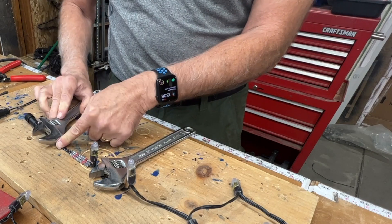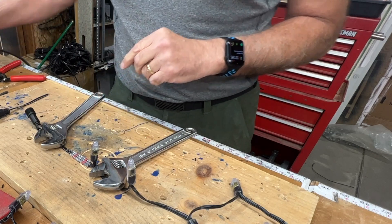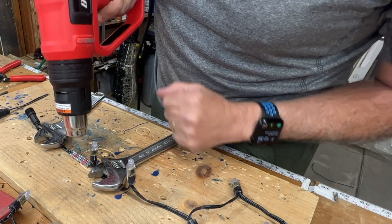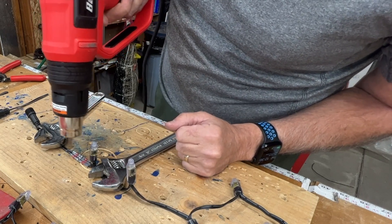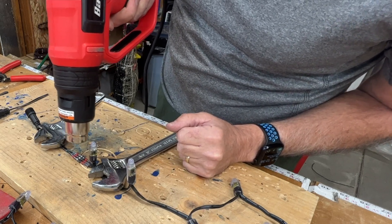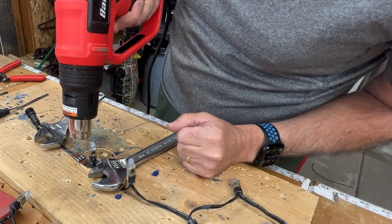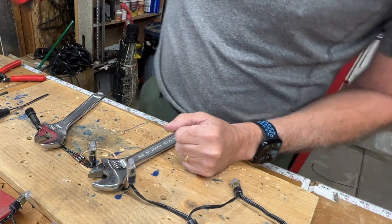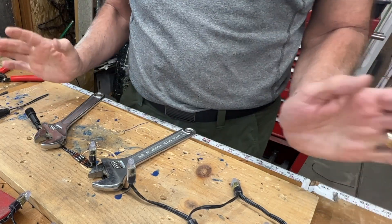I take another crescent wrench and hold that in position. Double check the lineup — it's all good. I have my heat gun and I'm going to zap it. Just keep doing this, watch it closely. It'll melt the sleeve, seal it up, and then you watch for the solder to start to flow. It doesn't take too long. If you do it too long, you might melt the wire and get a poor connection. There we go — it's flowed. The solder is in good position. Now I'm just going to wait for a second and let it cool off.